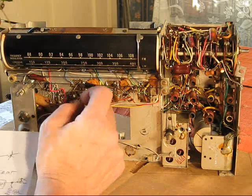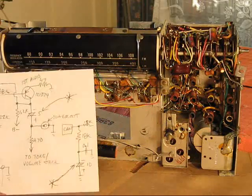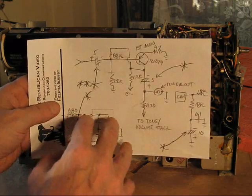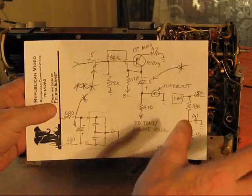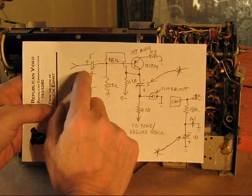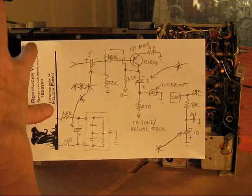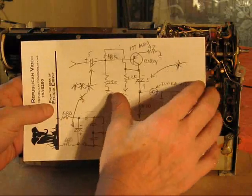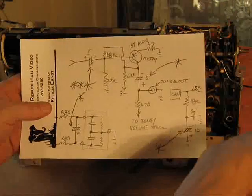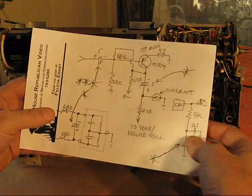I'm going to swap it out, but I'm a bit interested in what specifically has gone wrong. And there's some prime suspects with the FM discriminator circuit. This electrolytic would explain why the FM makes the hiss but no audio. It just can't detect the modulation. This one, primary suspect. That's why 3 stars. It is a coupling cap between the output of the actual radio parts and the input to the audio amplifier that drives the speaker. The fact that I do get noise through the speaker says to me the output section's working just fine, at least marginally.